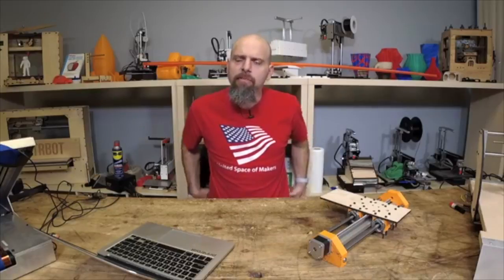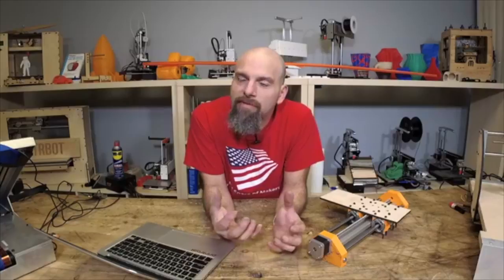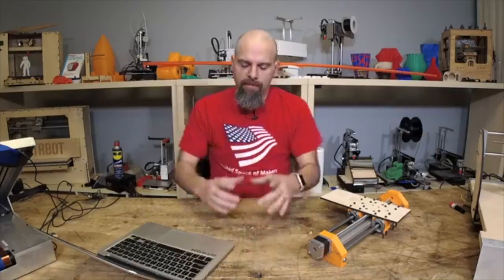We use a specific router, but I checked today. I bought a DeWalt 611, which is a real popular router that CNC people like. I mean, other companies use it. And we ship with another model. So I'll put links to the model that the mounting plate on the Printrbot CNC is made for. But I looked today, and making a bracket, all you'll really have to do is put down the router template that comes with your router. There's usually a plate that bolts on the bottom. You can just center it on the hole and drill your own holes and use the screws to put a different router on top of it. There's room enough for other routers. So you can choose your own router.